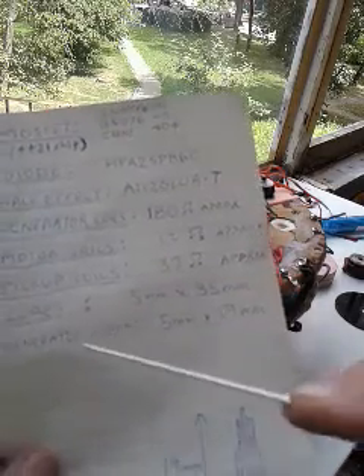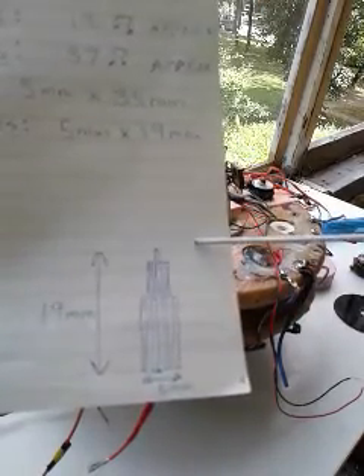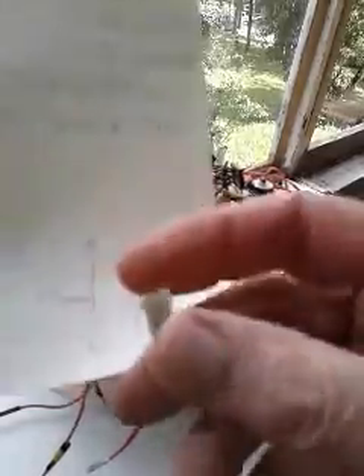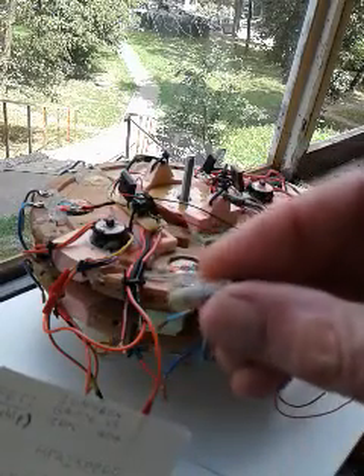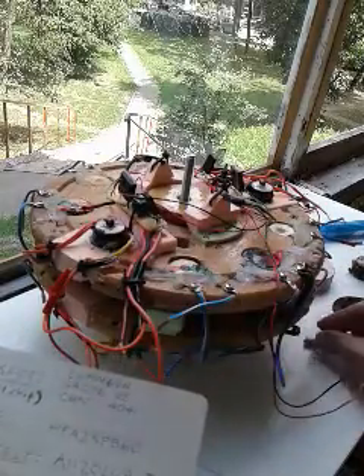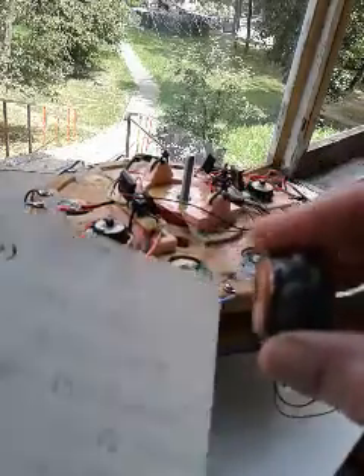The cores are 5 by 35 millimeters. Now the generator coils have a funny shape — they're also made out of 22-gauge florist wire. They have a little pinpoint that goes toward the magnet and they're 19 millimeters long and 5 millimeters wide. Here's one I took out — it has a bunch of epoxy on it so you can't see the shape too well.